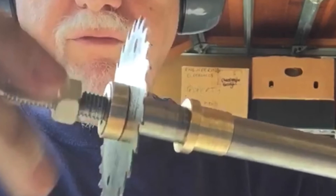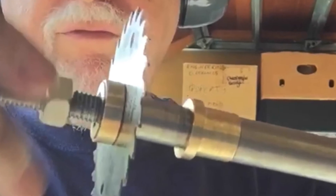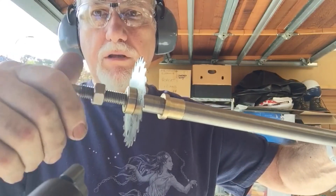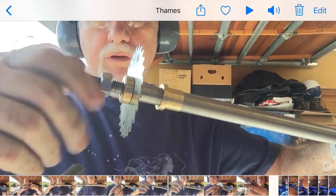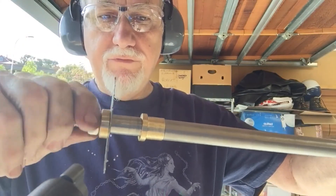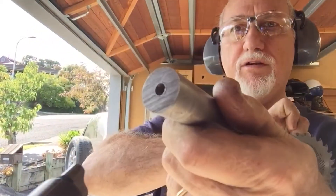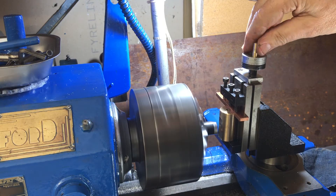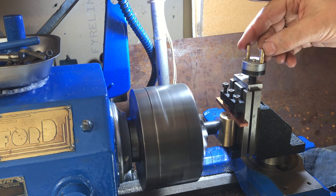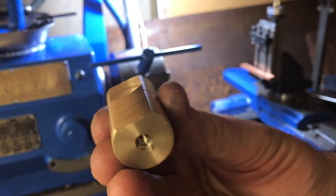You can also see a reduction in diameter at the very end to mount the circular saw blade, but it's also wide enough to hold gear wheels from the gear crank. We have a whole lot of spare gear wheels with different numbers of teeth, which can all be used as indexing discs and will fit on the end as well. When you're not using the thick gear wheels, there's a bronze spacer to hold the blade in place. In a previous episode I described setting up this milling attachment, and here we're using it with a flying cutter to make a flat face on a piece of bronze.